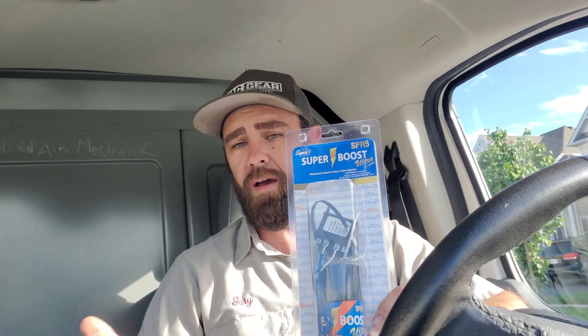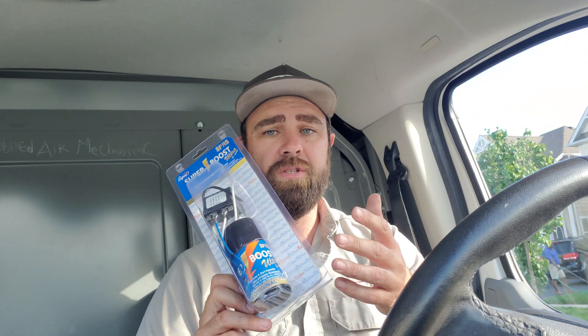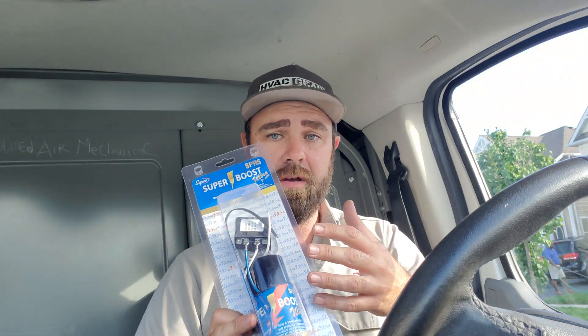We're here to talk about why you would use a hard start, why you should have one in your truck as a troubleshooting device, and why you should have probably three or four different kinds. Why would we use a hard start kit? If you go up to a call and the compressor is not turning over, not starting up, the starting components may have failed. If you don't have the correct ones, these are a fabulous universal tool to get the customer up and running. I suggest you go back and replace them with the correct starting components, but these are a great troubleshooting tool and a great truck stock item to get you out of a jam.